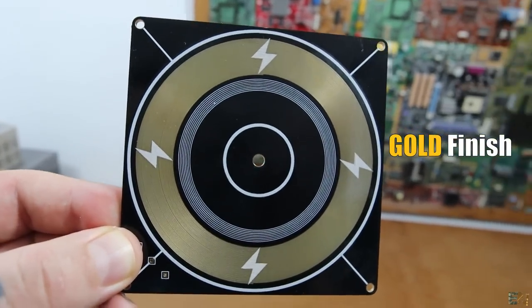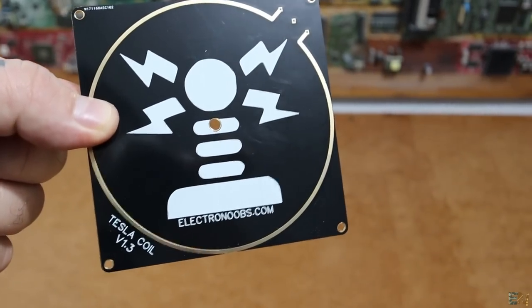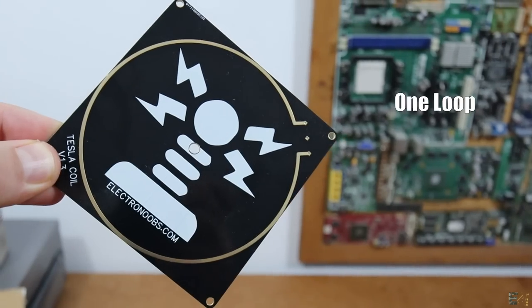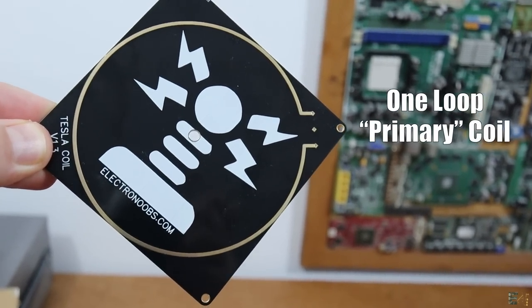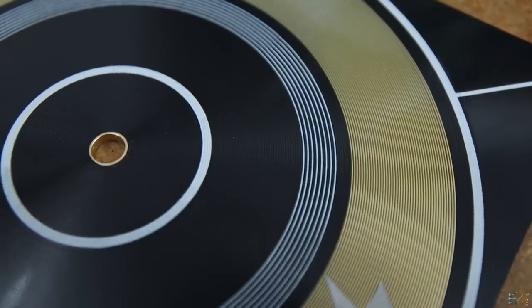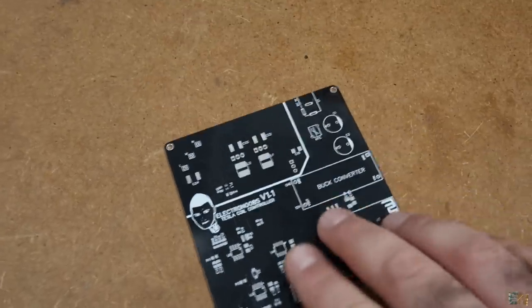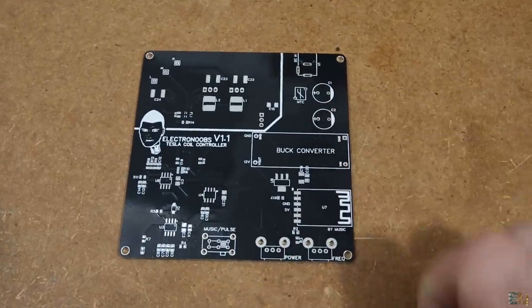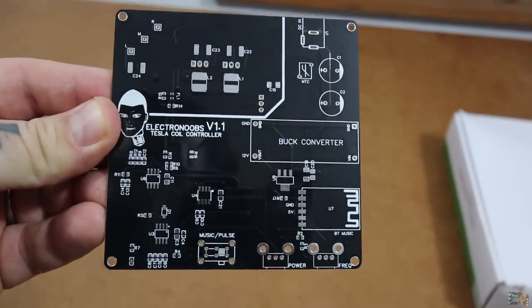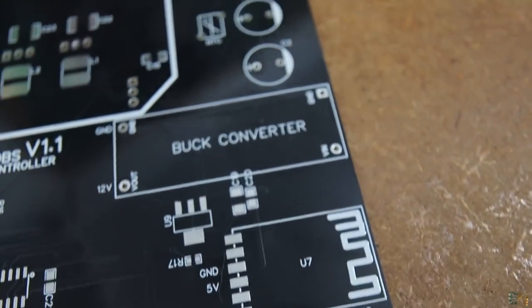As you can see, they look awesome. The windings are only on the top side of the PCB but on the other side we have just one loop, and this one is thicker because this will be the primary. The controller PCB has all the components: the power regulators, some timers, the Bluetooth music receiver, some power MOSFETs, coils and capacitors for resonance and so on.